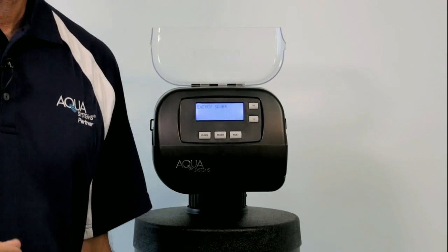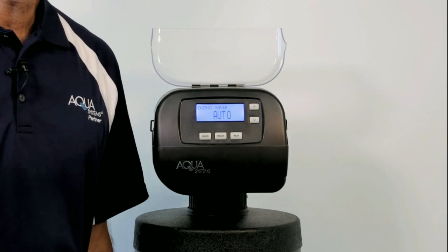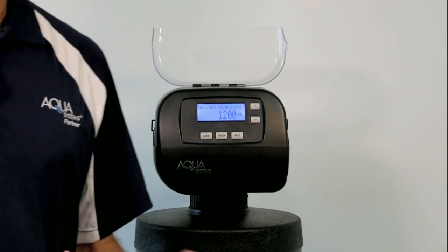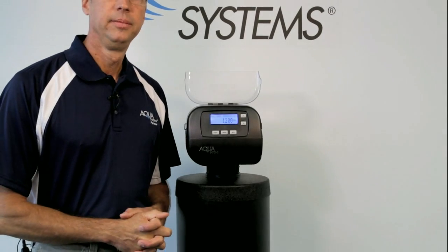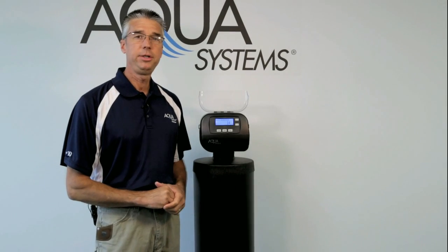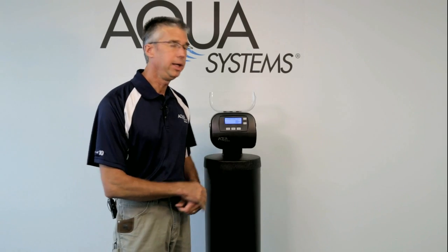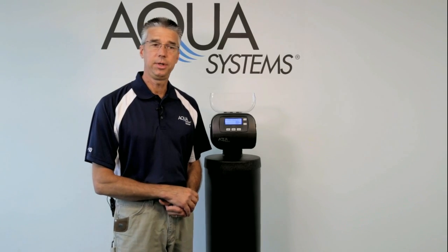called auto. Now it's important to understand that when the boards come from assembly, from the factory setting, they will all be set to auto unless you change it. That's important for an installer to know because they'll set the system up and turn away from it, and if no buttons are pushed for 5 minutes, the display will go out. And they might think something's wrong because that acts different than what they're used to. So everybody should get the notice and the bulletin on the energy saver. Make sure it gets into the hands of your installers and service personnel, and that when they go out, they'll be expecting this.